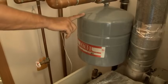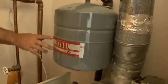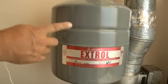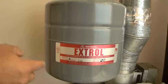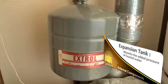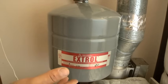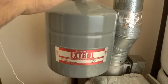The next piece is this expansion tank — one of the most overlooked components on a heating system. On one side of the bladder is water, and on the other side is air, separated by a rubber bladder. What this does is absorb pressure created when we heat up water. Water expands and is non-compressible, so it can get to very high pressures. The expansion tank absorbs that pressure, giving the water a place to go and keeping system pressure pretty consistent.